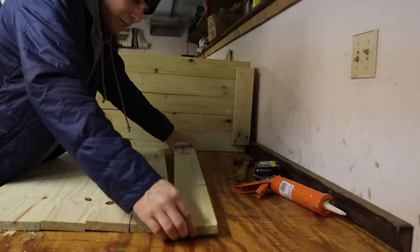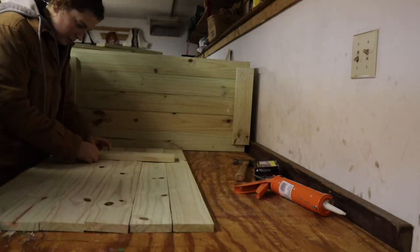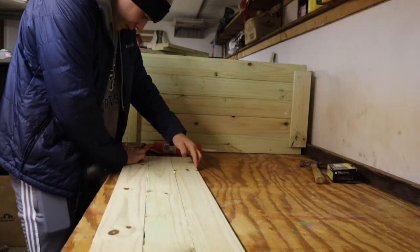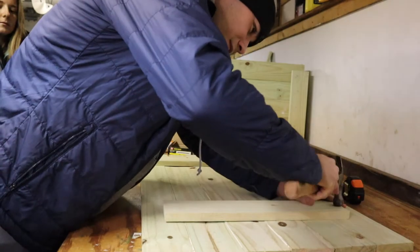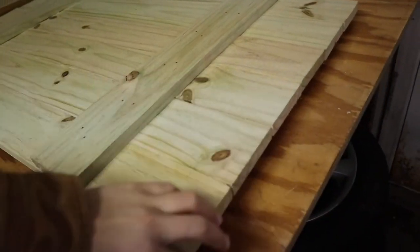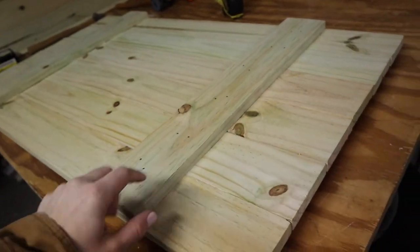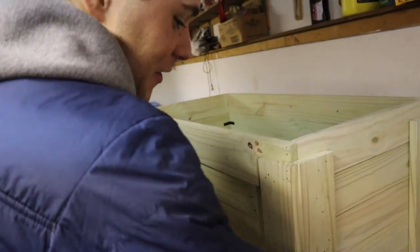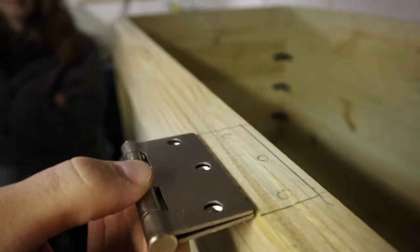Welcome back to day four — it may be day five, I've completely lost track. Our whole goal for today is to finish the lid. This is the finished lid — we glued between each piece and have double stabilization on both sides with planks. We're ready to get the hinge on. If we put it flush at ground level it should close properly, so we're going to chisel it out to get a flush fit.